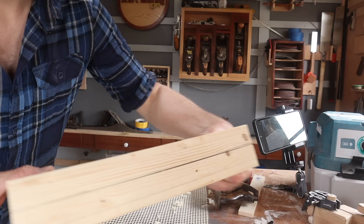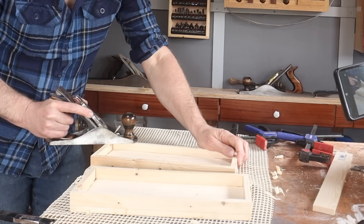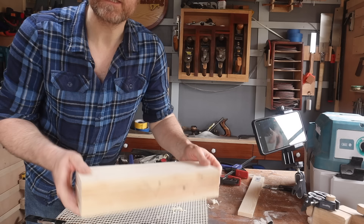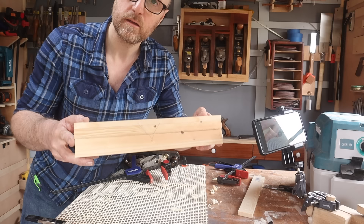None of that time have I tried to get it absolutely perfectly flat. If you close the lid and the base back up, see the tight spots. Then what you want to do is just take your plane and level off some of the tight corners, because eventually it will fit perfectly into place. Once you're happy with the fit, do all the rest. You'll get better as you go along and it will get quicker. Then we've got a box that you can decide what you want to do with.